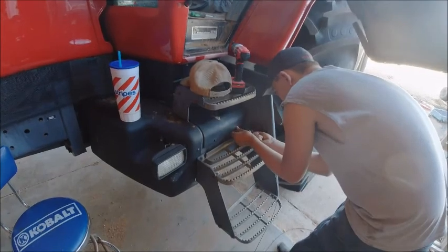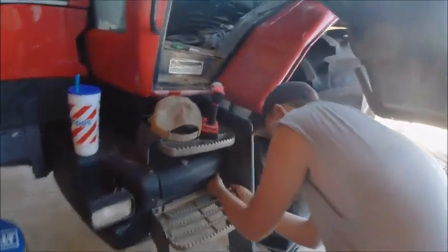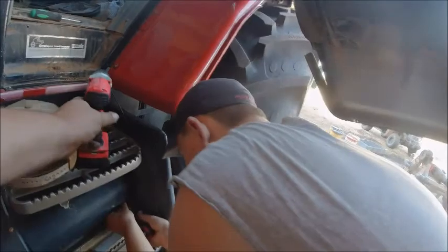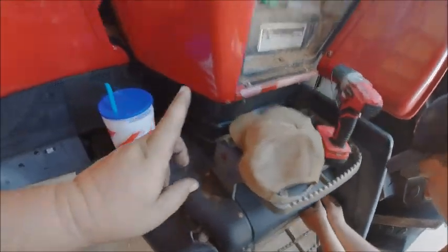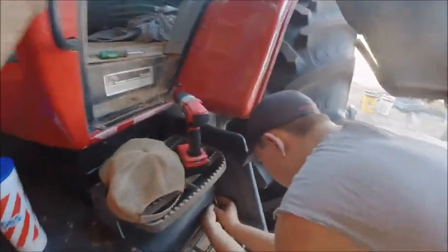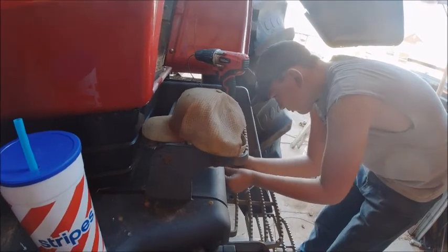Well, me and Drew got the tubes all cleaned out in this air conditioner. We took a speedometer cable off of a 79 model Ford pickup and put it on the end of a drill and stuck it in these tubes and ran it all the way up in there. And when it met resistance, we would turn on the drill while applying pressure and got the two tubes cleaned out. We got the other side and this one.